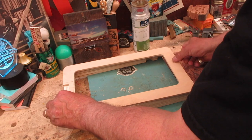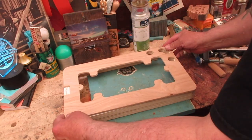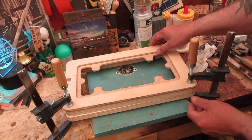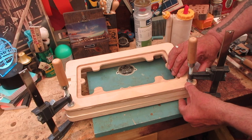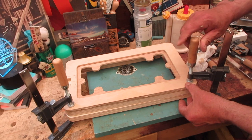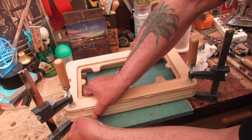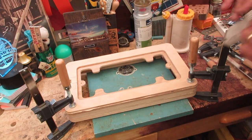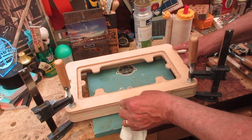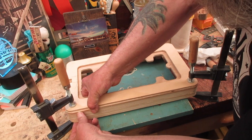Put the next layer on — oops, wrong layer — pay attention. These bodies will tend to warp a little bit if you store them in the wrong place. If your shed is extremely hot and then extremely cold, things are going to move around. When you start putting the clamps on, put the first couple on a little loose, and then you can see — I'm having to move this one around a little bit. Keep a rag here so you can see what the seams are doing.